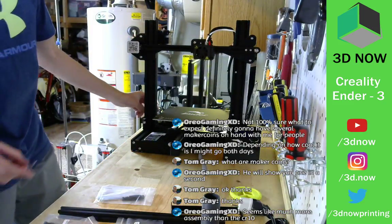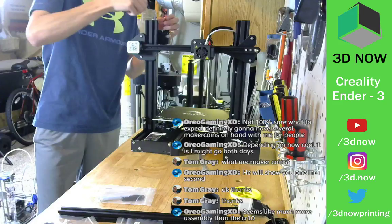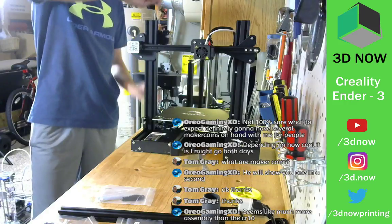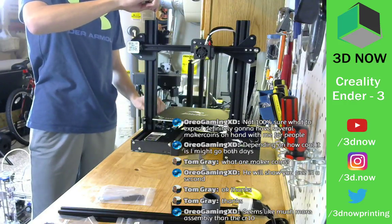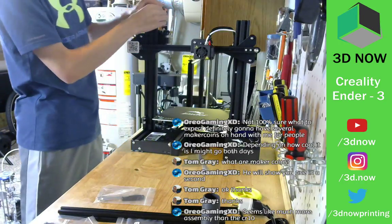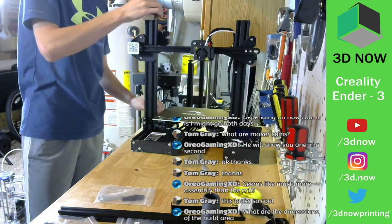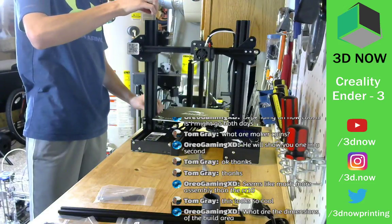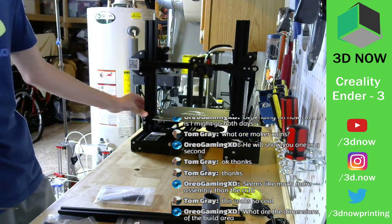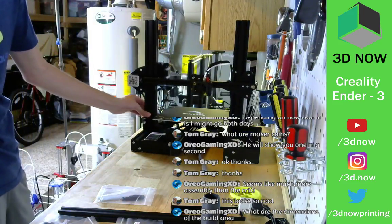going to tighten up the set nut. Actually, that's a bad idea. We want the set nut a little bit loose, because the tiny variances in the stepper in the lead screw will mess up everything. So there we go.